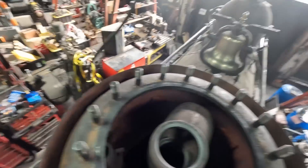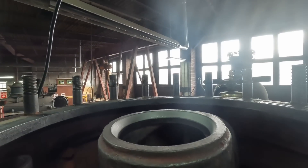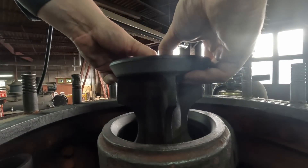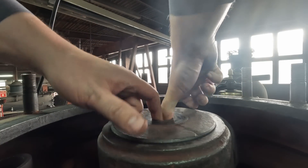That's what a throttle looks like and what the steam dome looks like. You put a whole big cosmetic cover on it — like you can see on 491's with the handles — and that's a way to make the locomotive look pretty without worrying about it. I'm going to gently put the plug back in here, as you don't want to damage the seats. There it sits. Those seats are incredibly important on the throttle — if you have any defect or anything blocking them you can have a runaway locomotive, even if it's just that much. Ask me how I know.